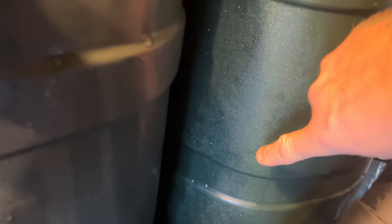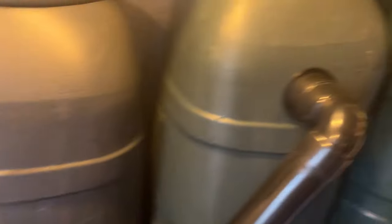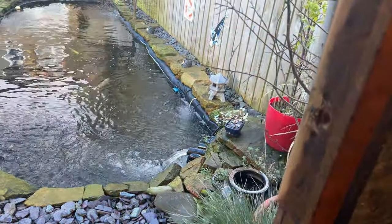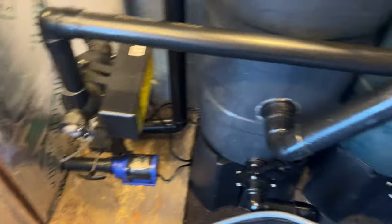To do so, what I'm going to have to do — and this is what we're talking about again, all last week all the barrels all sweated up with condensation — is switch off the pump, stopping the water flow. Once we've done that, I'm going to be draining down this barrel to below this point, about here. I'm not going to completely empty it, because the water would backflow out of this pipe onto the floor. I'll let it backflow as much as possible, give it an hour or so, then I'll take this one apart, put the new seals in, and pop it back together. Give us five minutes — we'll get all this shut down, filter switched off, this one drained off.